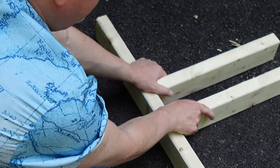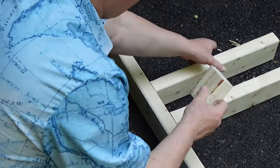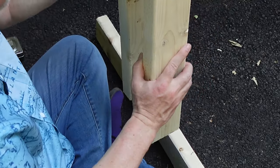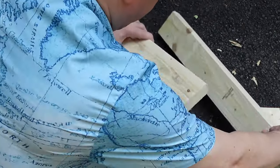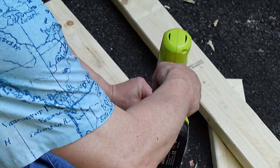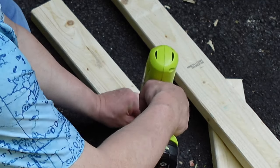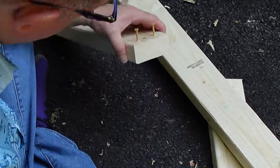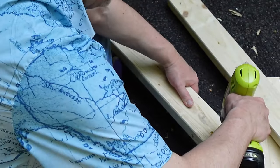I'm using this pretty much to eyeball it. What I might do to make things a little bit easier is if I use my spacer — I've already cut this piece — and come in here and mount it between the ends, then I automatically have my spacing. When I mount it to the front board, it's going to be a lot easier. Sometimes the easiest way of working with the wood is to get your screws started first, because otherwise trying to hold pieces together while working on your screws can be challenging. I want to get them started fairly well and then drive those screws in the rest of the way.